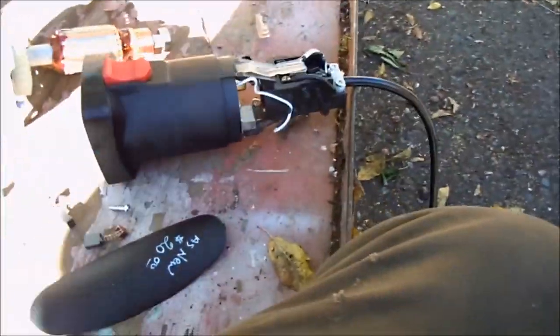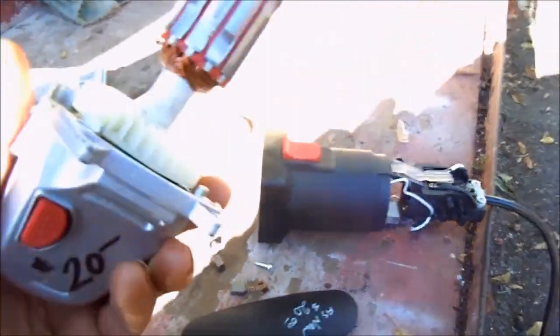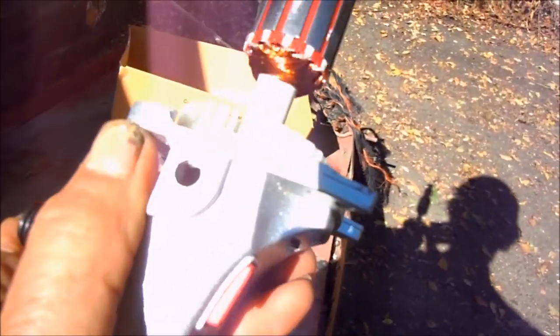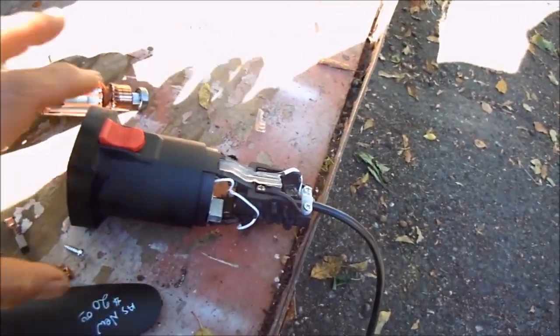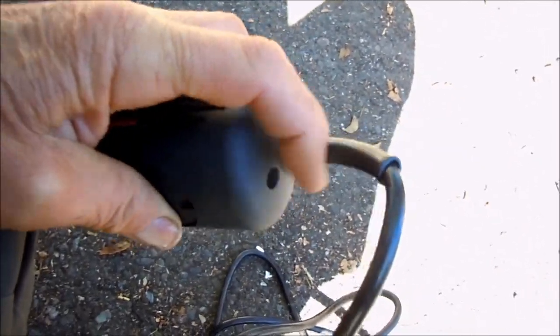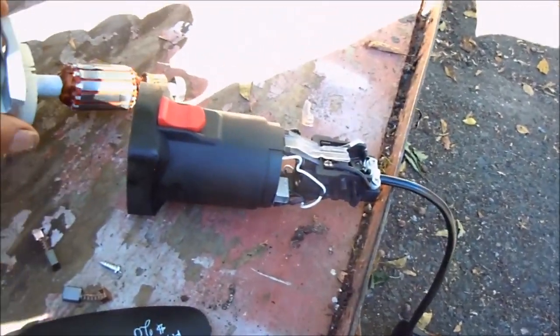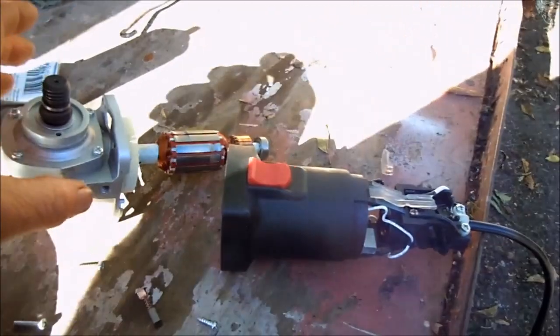Master drill grinder switch hack for today. I took it all apart — you didn't necessarily have to take it all apart, but I did just to look and see what was going on. I did clean the armature a little bit, and theoretically I could put a couple of drops of oil in there, some Tri-Flow. If you do take this out, you have to take the back part off — there's a small screw there. Take that out, take the back part off, and then take those brushes out. I took the brushes out because basically the brushes get stuck on this part right here, and if you pull hard you're going to break the brushes.